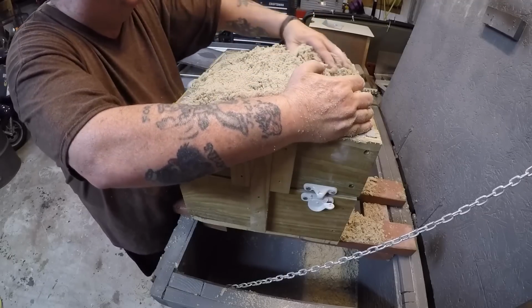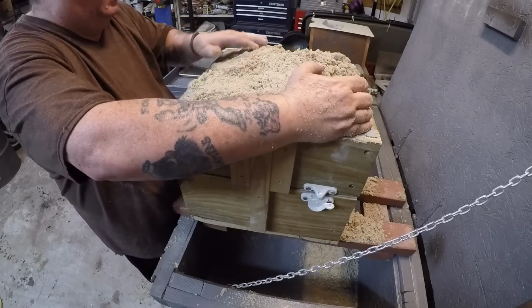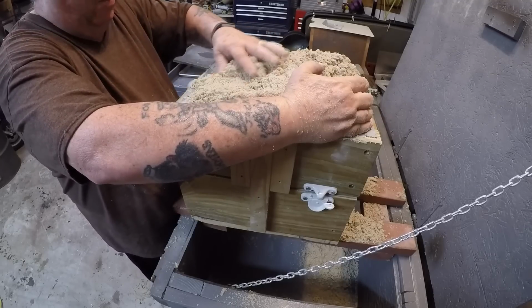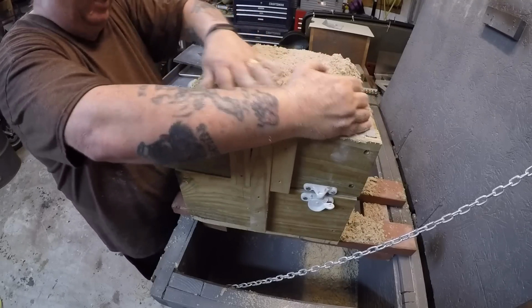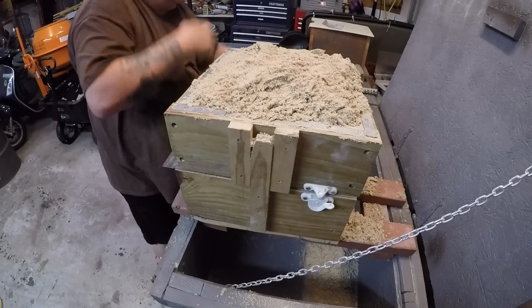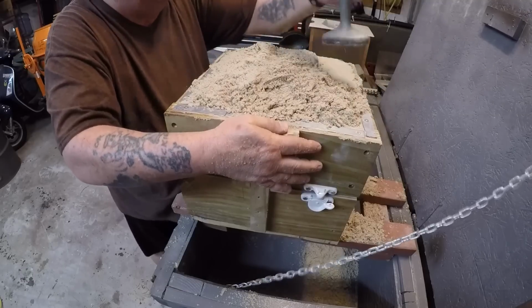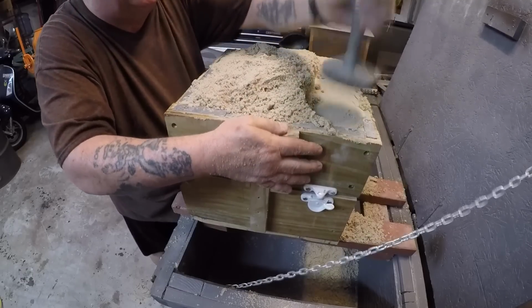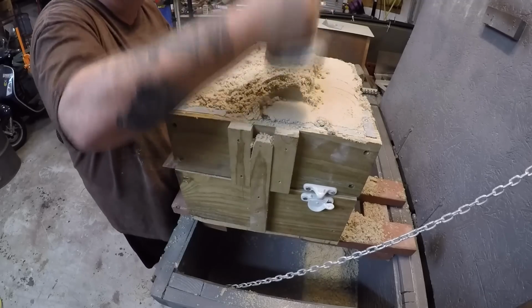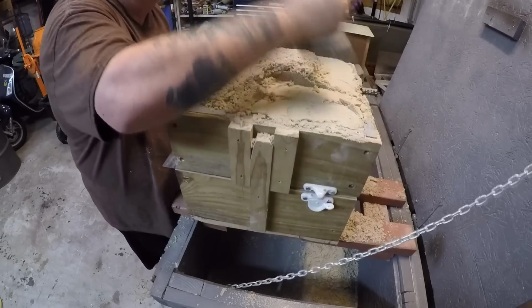Okay. Give yourself plenty of thickness up here. Make sure you uncover your sprue so you don't go busting your sprue by hitting it. Now this portion, of course, is the last layer that you have to ram up, and so the butt end, it's used.